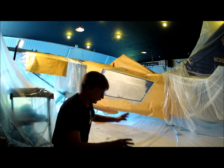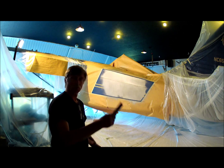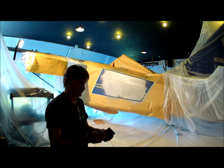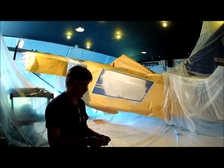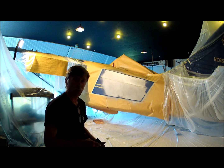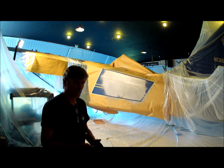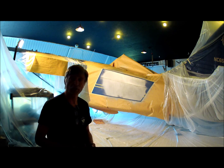Now, once this is all done, this requires a lot of sanding. So if elbow grease isn't your thing, call somebody else. We were going to have somebody else do the job here, but due to the climate and weather conditions, their projects in the shop were real slow to get out. This stuff is temperature and humidity sensitive. We had a pretty cold winter — and cold temperatures are not real good for doing this type of work. Neither is high humidity.